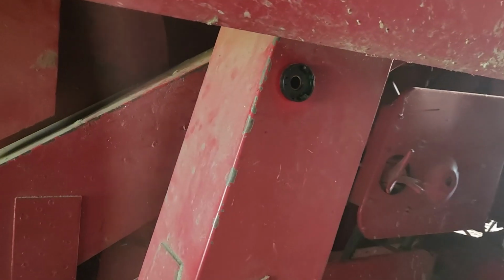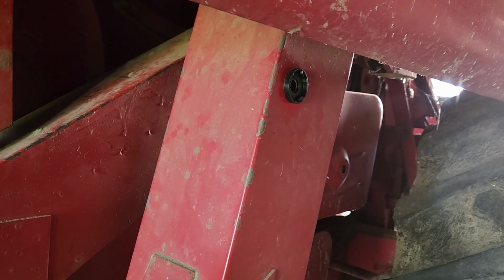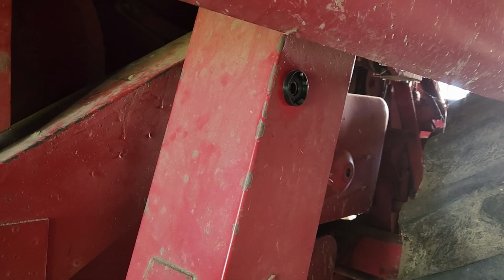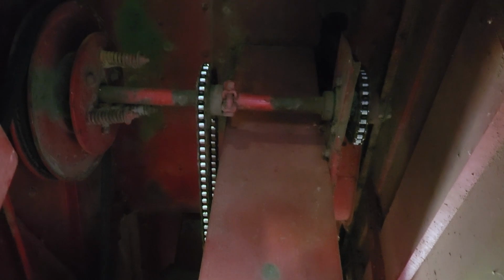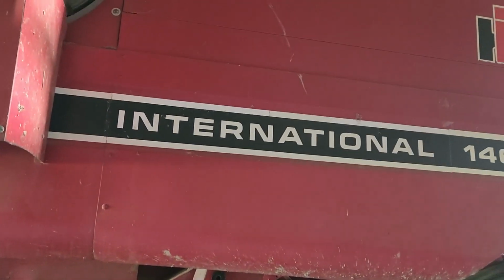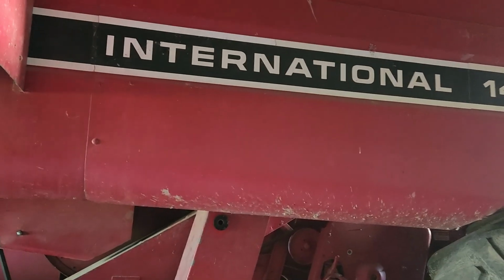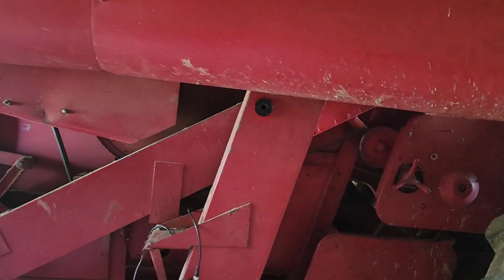First guidance they give you is getting it as high on the clean grain elevator as possible, so you have less grain spillage coming down, plus give the grain a chance to settle down on the way up the elevator. And sorry about the light in the background. You can get quite a bit higher up in here. However, to get access to drill your holes and get a drill in, this is the location I went with. It's easiest without having to take off the entire side panel here, which isn't easy since it doesn't just swing out like it does on the other side.